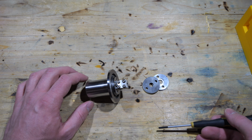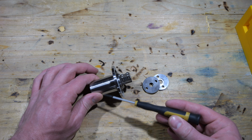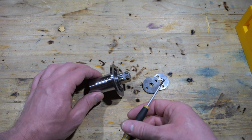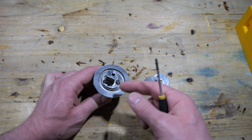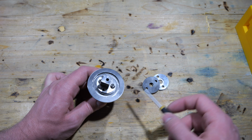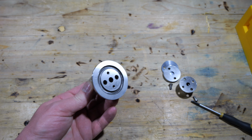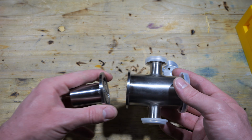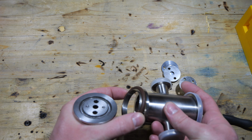There are different types of atomic beam furnace, but the one I'm going to use is basically just a heated chamber with the element, in this case potassium, inside. When the potassium gets heated in a high or ultra high vacuum, the atoms will vaporize. And of course, in a vacuum there's nothing to stop them from flying in one direction. So, you can see that this is the main chamber, and here is a KF40 flange. Just imagine this is the vacuum chamber, and it's just going to attach like this, and an O-ring of course goes in between those two parts.